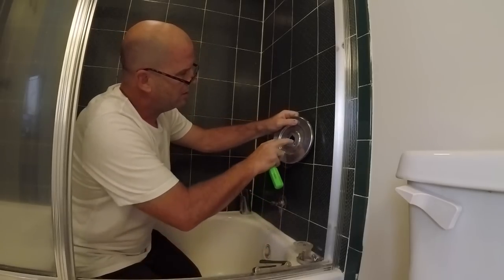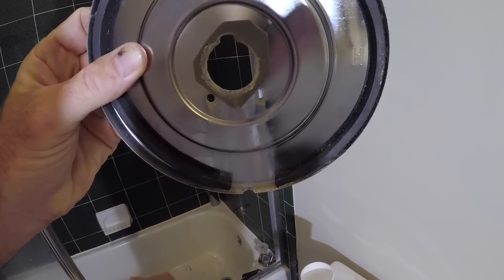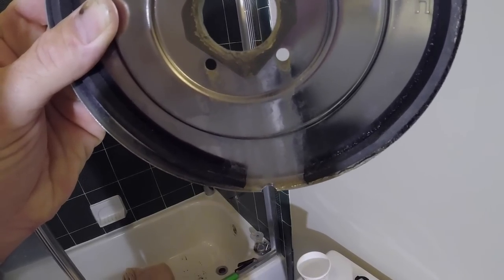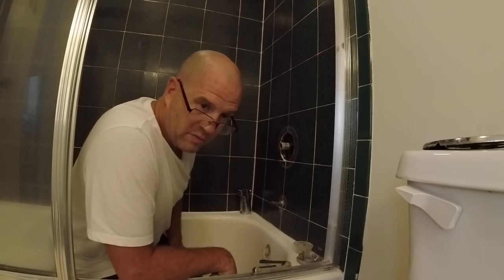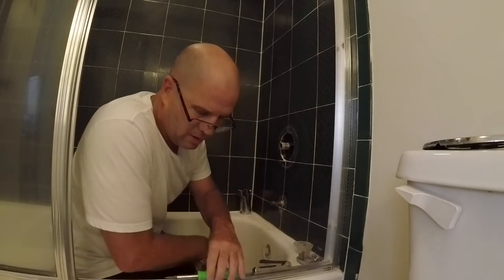Here's the fun part. I'm going to bring the boss lady and explain. Here's the plate — we got water leaking through perhaps, as shown by the stains. I'll be honest with you, I really want to know if that little cutout in the plate is designed to let water drain off. I'm going to say yes — if you know, leave a comment below and let me know. I really think it's the waste and overflow, the overflow part. I need to check my putty situation. I'm going to pull this out and redo it without cutting the ceiling or cutting the trap.